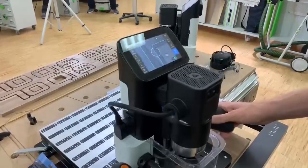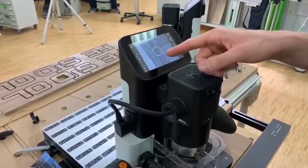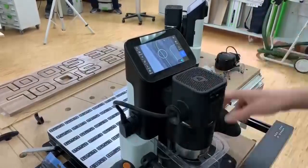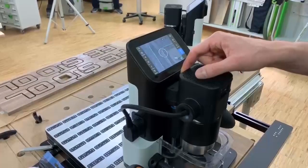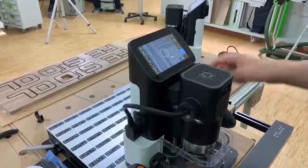So in cut mode, you see all the contours which you can potentially cut. You can change them from outside cut to inside, for example. But now we want to have the positive, right? So here's the O, and I definitely want to cut on the outside and, of course, on the inside. Let's start with the inside to get rid of the little square shape.